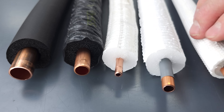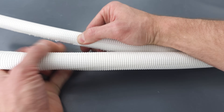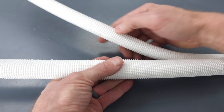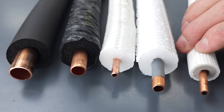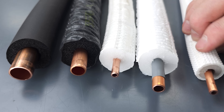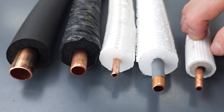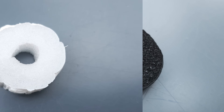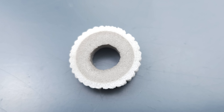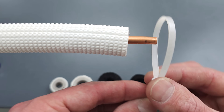When you pull this particular insulation away from the other line set — connected with a vapor line — you're already ripping through that outer layer, and it's really not very thick at all. Line set insulation manufacturers may make a variety of different insulation types, so this might not be a problem moving forward.